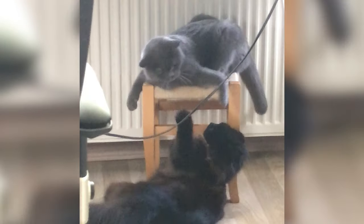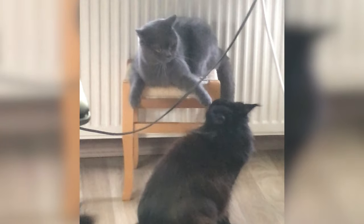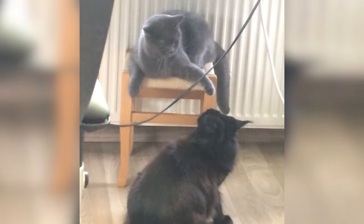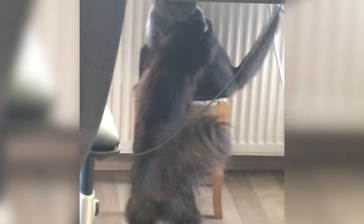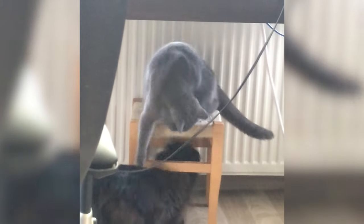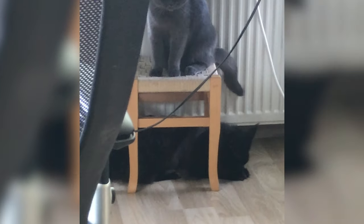I guess I'll begin with the Voron. For the Voron, I'm waiting for some Chinese parts for the 2.4 upgrade. Most of the parts arrived, so I don't expect the wait to be that long, but still I'm waiting for some stuff. Plus, on top of that, I decided to do the 0.9 stepping angle high temperature LDO motor upgrade for the gantry for the A and B motors, and I ordered the high temperature motors, so again I'm waiting for those as well.